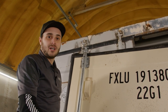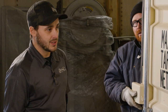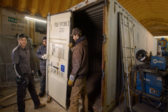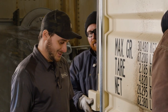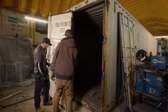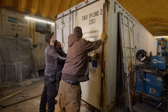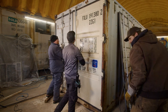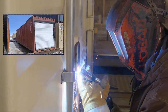Since we made a significant adjustment by jacking up one side, we're going to hold this door up again and see how everything's lining up. Maybe it'll actually latch now. We don't want to make any changes prior to testing it out one more time. We are smarter this time — we got a third set of hands. Matt, William, and I will lift this thing up. As you can see, this is not for the faint of heart. There are three of us all working together problem solving. That's why a lot of times I don't suggest swapping out your container doors — often it's easier to weld them shut and put a roll-up door in the other end, or install a roll shutter door in the door end.